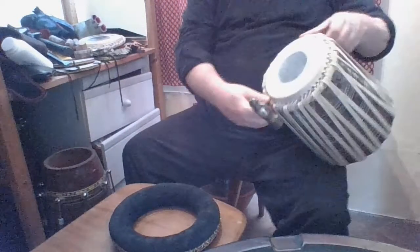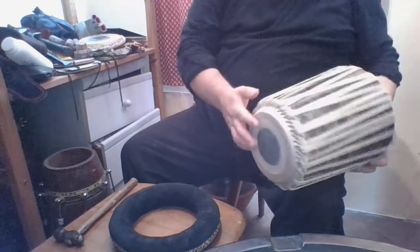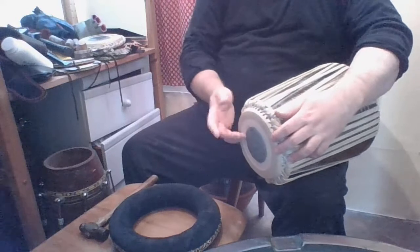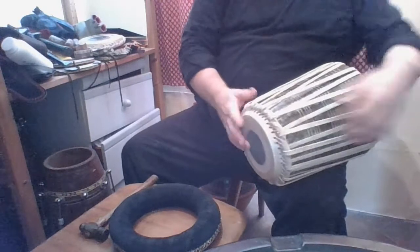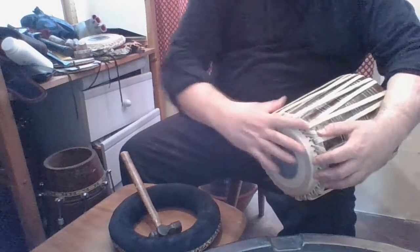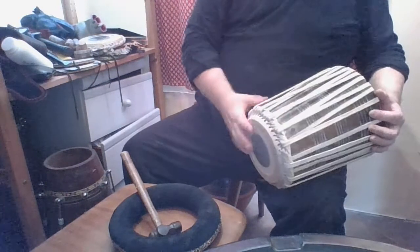You don't go too crazy straight away if you don't have to. So you put it on your knee like that. Low, low, high. So let's get the high bits down a bit. So little taps to start with. Then assess. There's a high bit. So it's sort of there, that sort of whole area. Just some light taps. You can hear it going down a bit. So then that's still quite low.